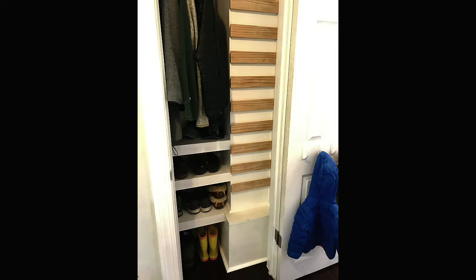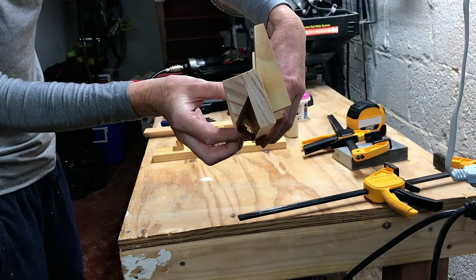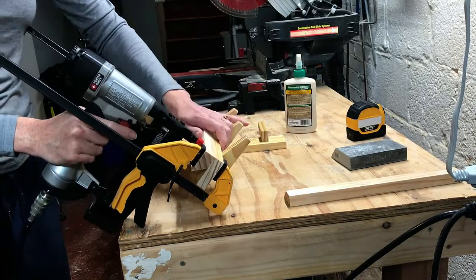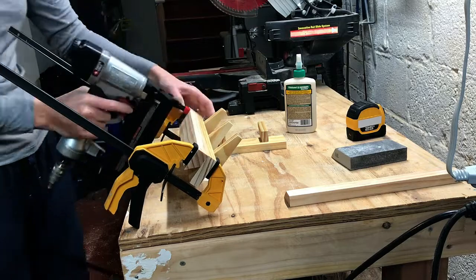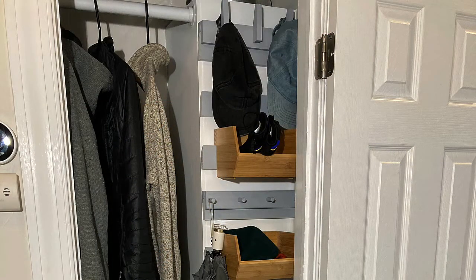Now that my cleats were ready, I made a few accessories by attaching the leftover cleats to the back of some hooks I had. You can trim down the cleats on your table saw to make them thinner — just be sure to trim from the squared edge and leave the 45-degree angle intact. I put glue on the back of the cleat, made sure the 45-degree angle was pointed down, clamped it, nailed it together, and let the glue dry completely before painting.